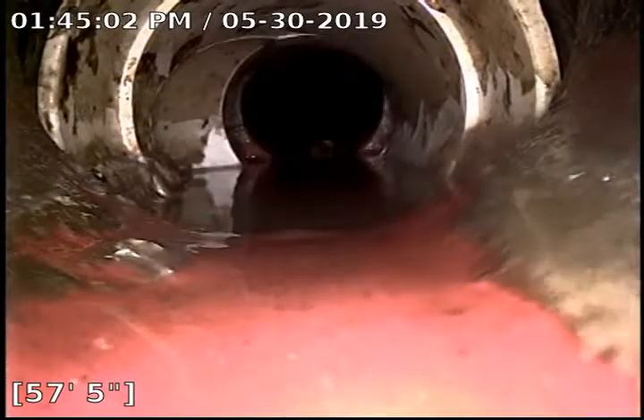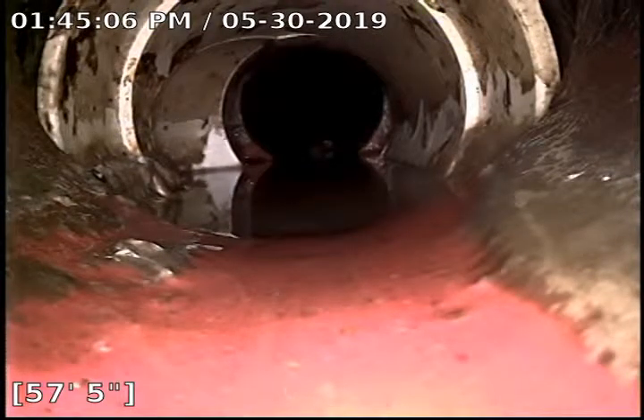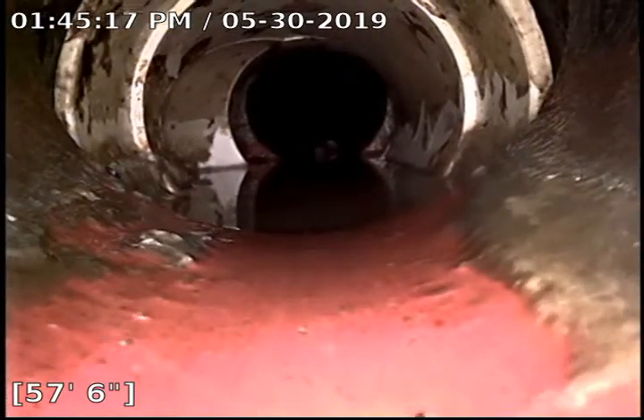And I can't get past this — it just won't allow me to go over that hump. I believe this is the T that ties in the newer bathroom in the newer part of the house to the south. So I'm going to start coming back, show you what I'm seeing, and then I'm going to attempt to go down that other stack and see if I can get farther than this point.